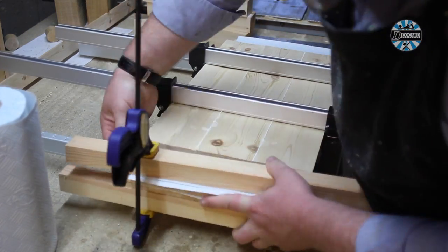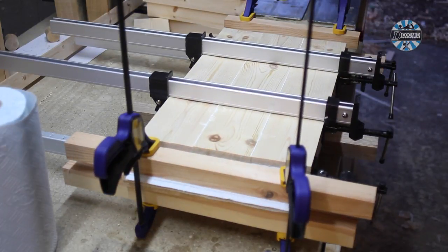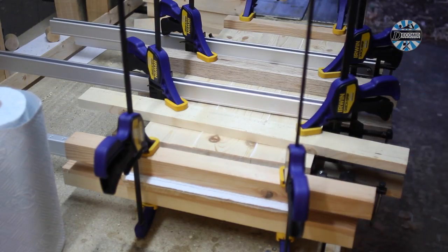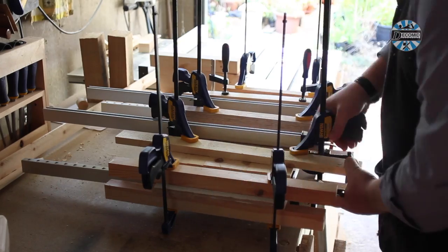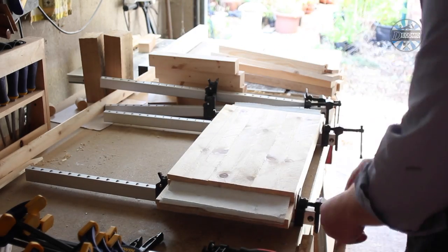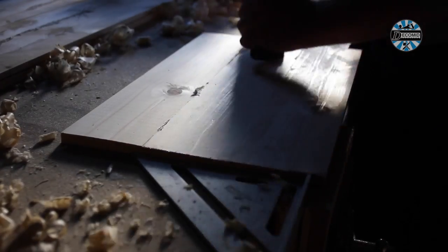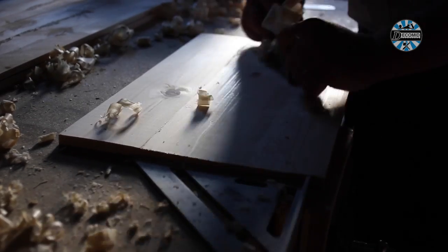The clamping of this was a bit tricky. The side panels are thicker than for a bin, and my clamp's not deep enough. I also had to use pretty much every small clamp I own to hold the batons in place to keep things flat. Thankfully, the next day, unclamping was very easy. Some light planing and scraping to the surfaces was needed to tidy things up and remove the glue and paper.